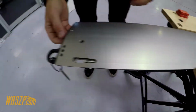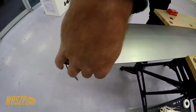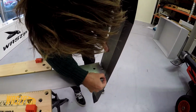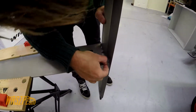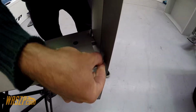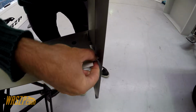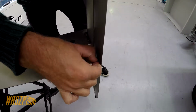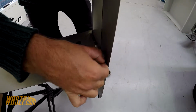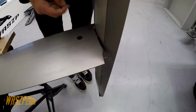And what we're going to do now is you'll be able to see that your push rod will be able to spin freely. And spin my push rod until it starts going into the barrel nut. So this one's spinning all right, going in. So once I've got it 5 to 7 turns into the foil, you'll be able to see there's no thread showing.